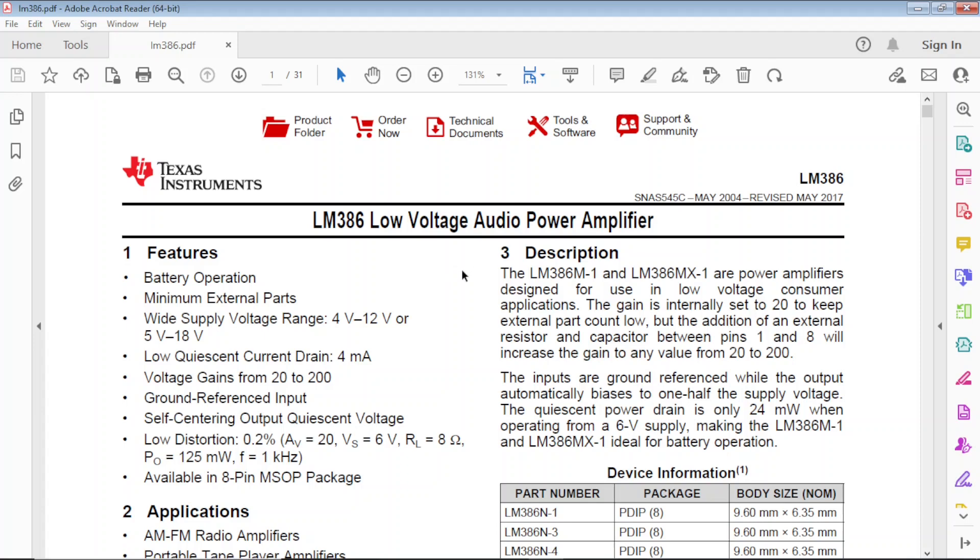There are variations on the Smoky design — one is called Ruby. The main modification is a preamp using a JFET. You don't really need it, but it can help because of the impedance mismatch between the guitar, which is very high impedance, and the input impedance of the LM386, which is high but not that high — about 50k ohms.